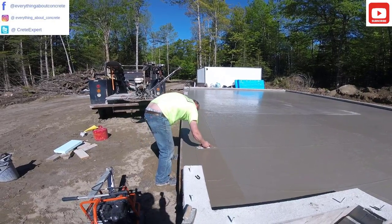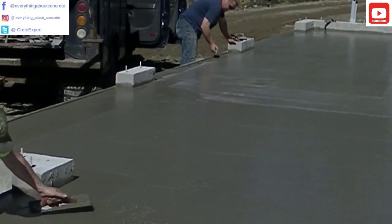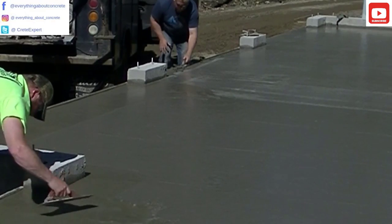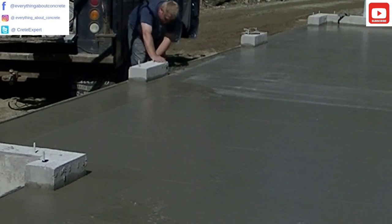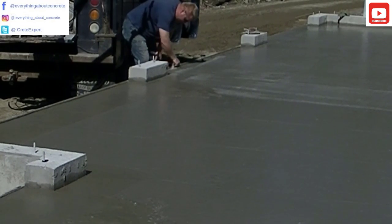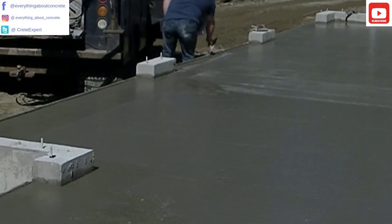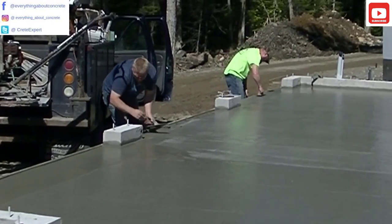He's going to finish up that door and then they're going to do the other two. Stay tuned — take a look at how Luke's doing it. Luke's going to cut it down — he's digging that down again. It's the same garage, just doing the middle door. He's digging out that excess. This is probably about 30 minutes or so after we got done pouring the concrete. We don't do it immediately after because the concrete's still a little too loose and it won't hold the taper or the slope very good. We let the concrete set up a little bit.